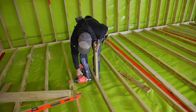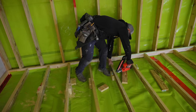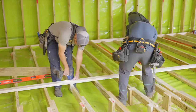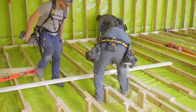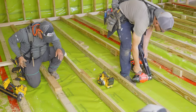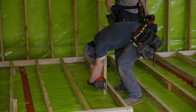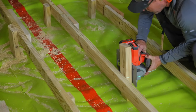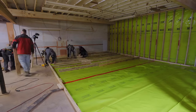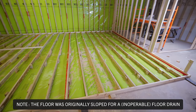To prepare for adding the sheathing, Eric and I got a layout board attached to the joists to lock them on layout in the middle of the platform where they could shift left and right. We got the last few joists set, then went around adding more feet using up most of our scraps. We also wised up and started cutting the feet flush with a circular saw, which was much easier. All in all, while maybe unconventional, this technique ended up working great and really simplified the process of building the platform over this sloped floor.